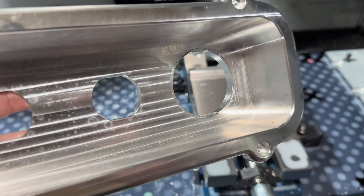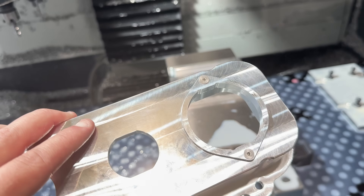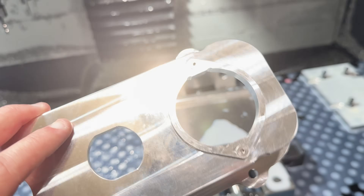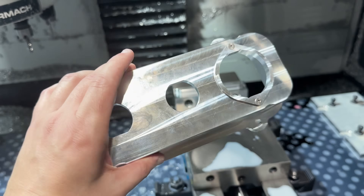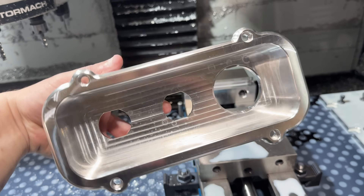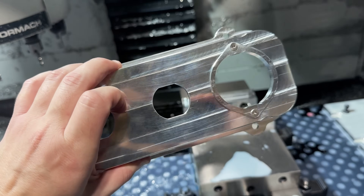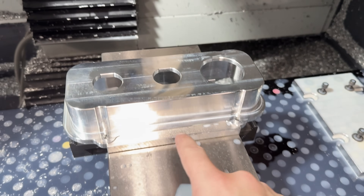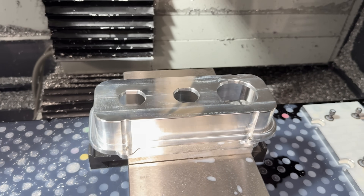Here is that item sleeved. You can see there's the sleeve, the cut to prevent rotation, and a little bit of corner relief to help it go in easily. Here we did all of these, and I'll show you the modification of how we approached this. That is the finished item before the disconnect and the terminals go in. Ironically, I had to cut soft jaws to redo all the work — so the joke is I should have just done it in three operations instead of two. Lesson learned.